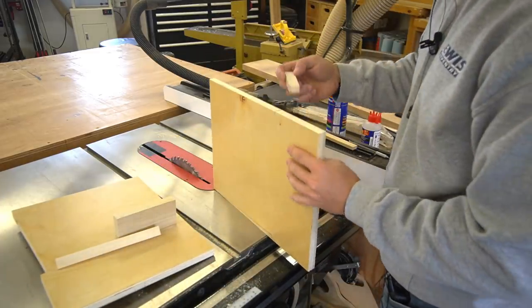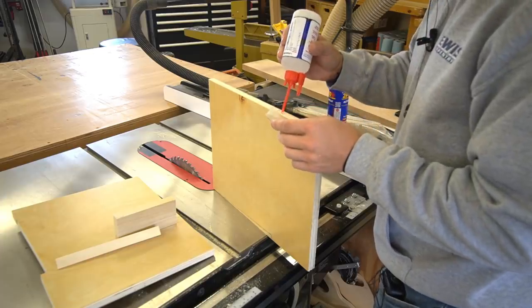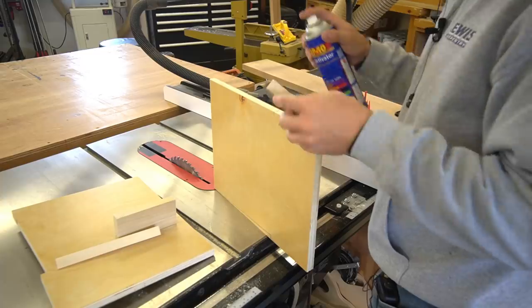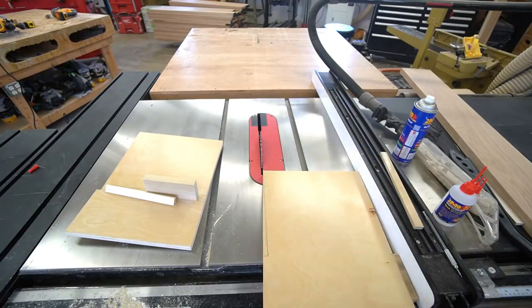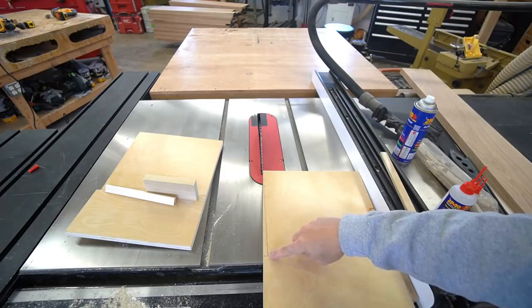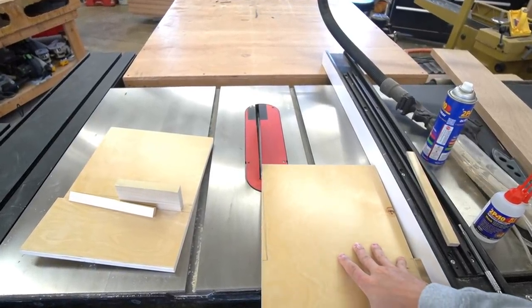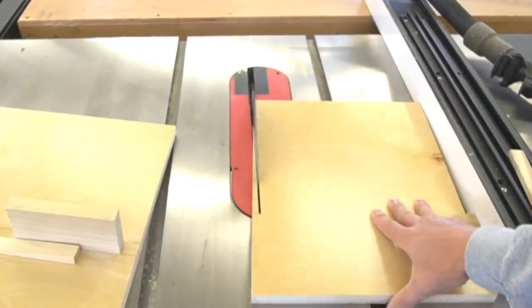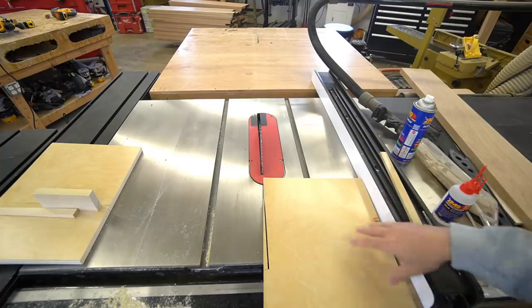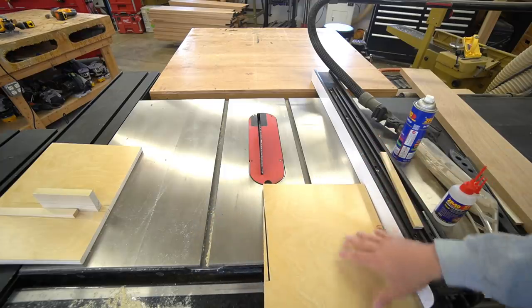So here I've got a half-inch piece of scrap. I'm just going to take a couple little blobs of CA glue — this is just going to temporarily tack this piece on and it'll be really easy to knock off in a second. Our piece of half inch is tacked onto the side. Go ahead and raise your saw blade up as high as it'll go — that way you get a nice plumb cut. When you get back to this point, we'll cut all the way to our line right here. Probably the easiest way to make this cut is just to flip it around and do a quick little freehand cut right there. I don't want to move this fence at this point.